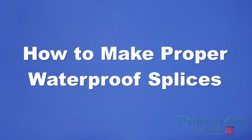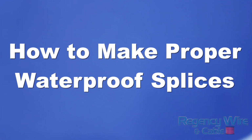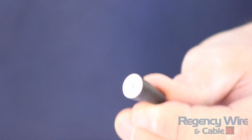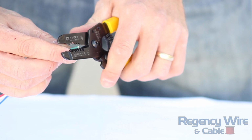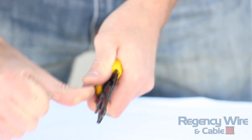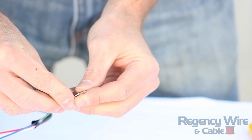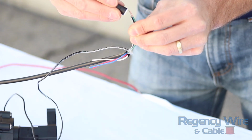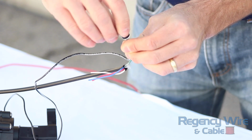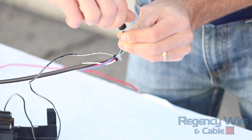There are a wide variety of irrigation electrical connectors that are approved for outdoor and direct burial use. The most common is a twist-on style that contains a water-repellent grease or sealant. To use these, you strip off a wire about one-half the depth of the connector. A typical connector can be used for up to 3 wires. Place the stripped wires side by side, and then twist on the wire connector with a clockwise motion. This will draw the wires together and into the spring mechanism inside the body of the connector.